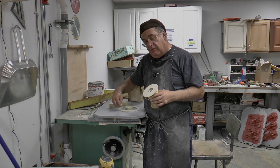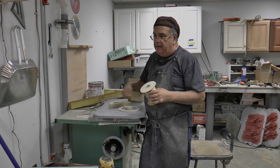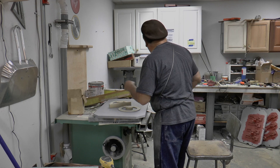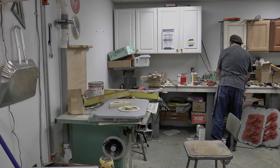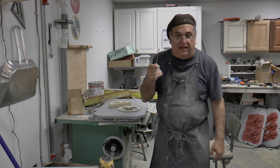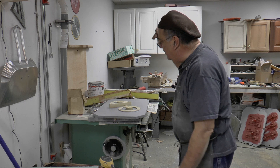If there's a sharp corner and when they pull it out of the mold, what could happen is a little sand drop there. They blow the mold off - maybe, maybe not. And that sand will wash right to the rim. So we try to avoid that as much as possible. That gets melted with an alcohol lamp. We use an alcohol lamp with denatured alcohol - you light it off. And you can't use a candle. A candle has black smoke and the black smoke will make a lot of mess on there. Do not use a candle.